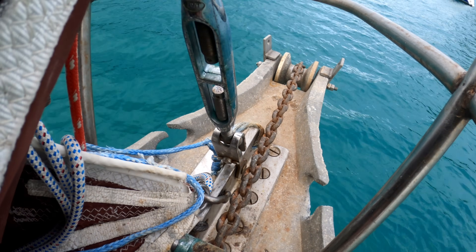A really common question I'm always asked is: how tight do you make them? This is not bar tight — not a metal beam that can't be moved; this has some wiggle. Compare that to the inner forestay, which I haven't tightened yet — too much wiggle. The answer depends on many things, but generally you want them as loose as you can possibly have them, because looser means less stress on the rig and fewer things to break. Cap shrouds and the headstay have to be tight if you want to go to windward. Downwind you actually want a looser headstay so it bows out. Since we have a backstay adjuster, don't set the headstay as tight as possible — you can always tighten it a little more, and downwind that headstay sag pushes it out and everything's good.